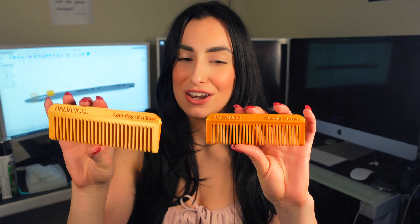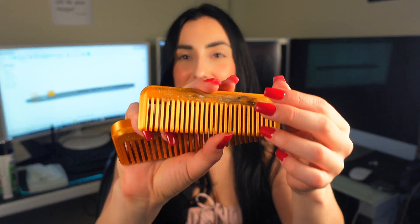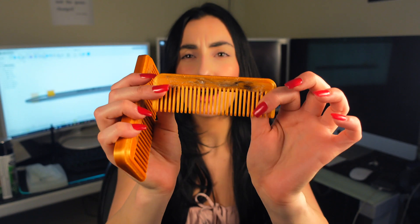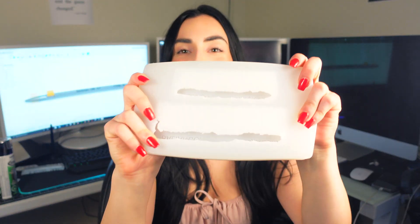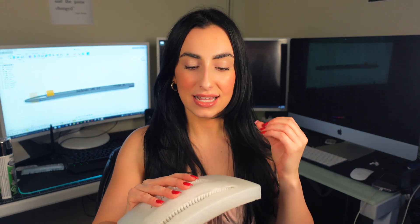I did touch on this a little bit last week. This model was made on Fusion 360. There is hot glue on there because I had to create this silicone mold. This is by no means perfect — it's actually a very bad mold design. After the fact, I realized I should have made the 3D model a lot thicker so that when I submerged it in the silicone rubber, I could just pull it out and there would be a very flat surface, not a bumpy finish like how it turned out.